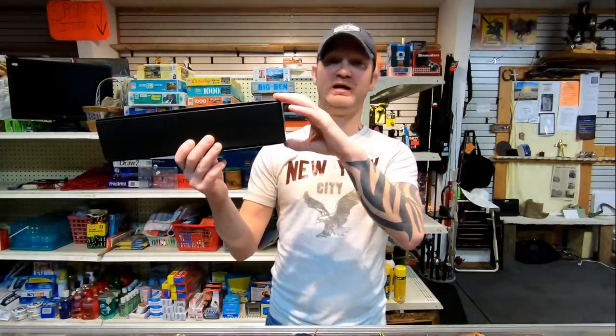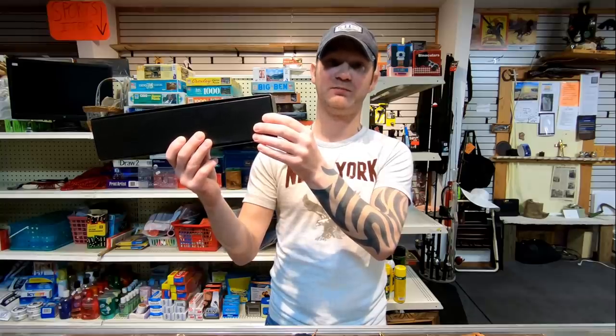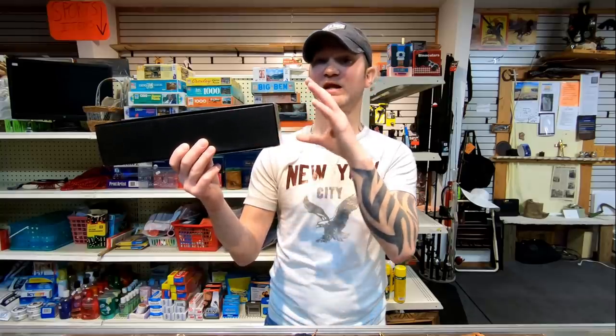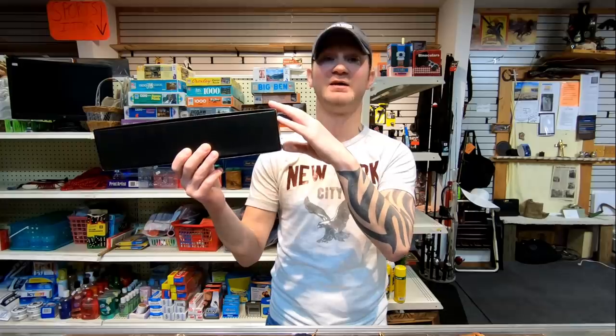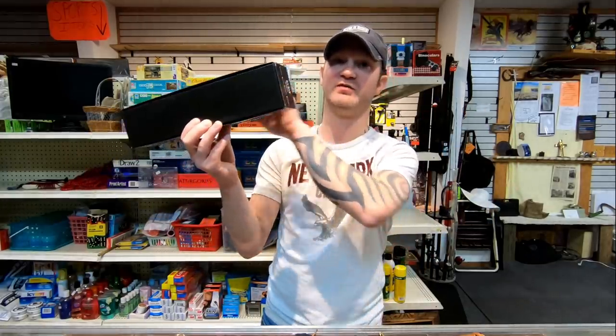Now, if you were to hit a situation where a solid piece of metal would be stronger than the I-beam, and the solid piece of metal would hold the load and the I-beam of a similar size would not, it would just be cheaper to use a bigger I-beam because of all that material you're saving.